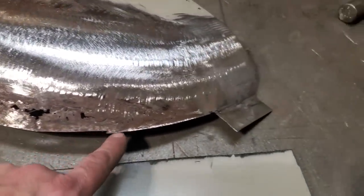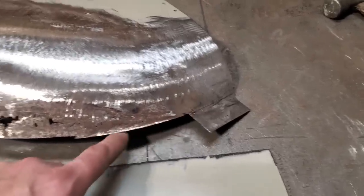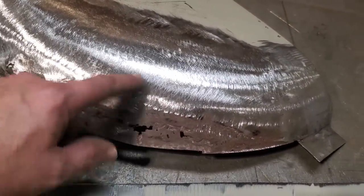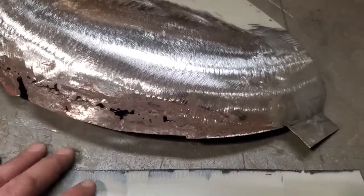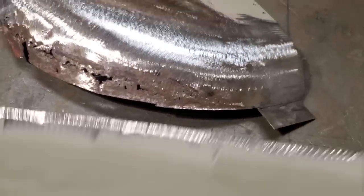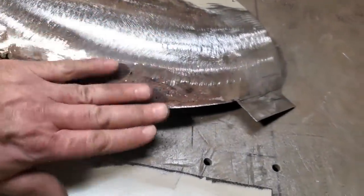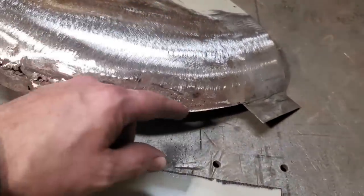This is my edge here, okay? This is my rolled edge. This was cut right in the middle of the rolled edge through here. So I want to have a reference point from here out to wherever I go to here to be left. I'm going to set this all up. And all I'm going to do now is fit this into this. Put a bit of a roll in it so that it fits on the right angle going this way, okay? And I'm going to roll it and fit it. And then I'm going to start sizing up where to trim it.